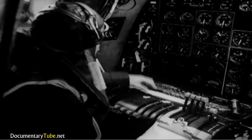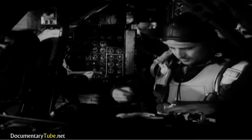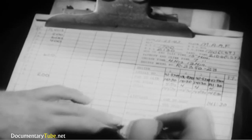Ask the engineer for Forms 1, 1A, and 01-1-40, and look them over. Be sure that everything on Forms 1 and 1A has been checked. Pay particular attention to the list of defective equipment. If anything vital is out of order, it must be fixed before taking off. The weight and balance computation is in Form 01-1-40. That's important. Make sure it's correct.